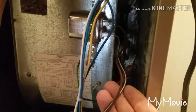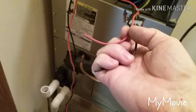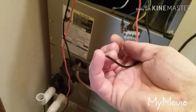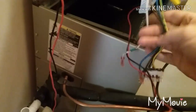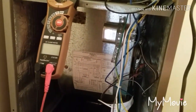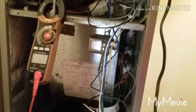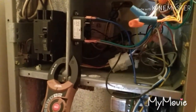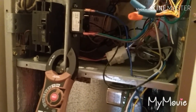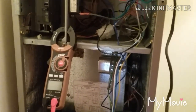I've got the 5 microfarad capacitor wired up. This is a three-speed motor: black is high, red is low - I won't be using those, so I'll tape those ends up. For the low voltage wires, I'll tape those up as well. I'm going to get everything zip-tied and put back together looking neat. I just wanted to show you and give an explanation of everything, so that in the future if you want to bypass a bad ECM motor you'll know what to do.